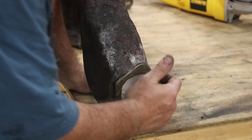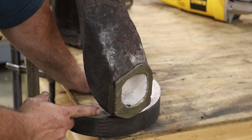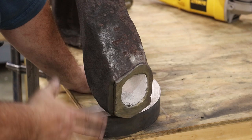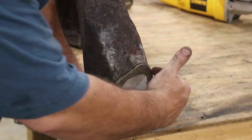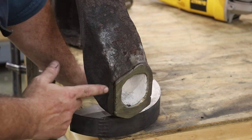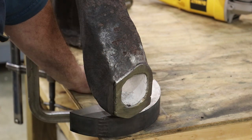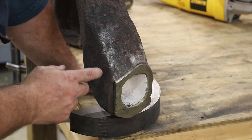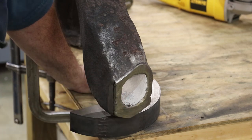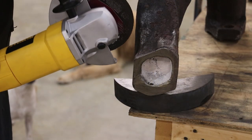This back side on this is the front side that you were looking at in the locomotive, and it was pretty uniform. I mean, it's off a few thousandths, but it's fairly uniform from one side to the other. Same thing in the back. Top and bottom was about the same height up, but we needed some more over here. So I'm going to zip that off. And I think to do that, I'm going to probably just use the cutting wheel and then probably get in here and grind it out the rest of the way. All right, cut off wheel.